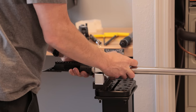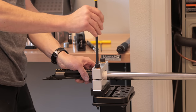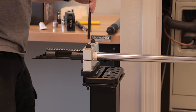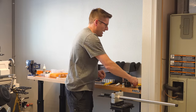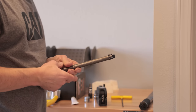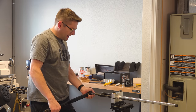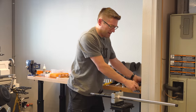Make sure that we don't have contact with the blocks, then just slide it into place. Short Action Customs actually provides the torque specs for these, but I have a pretty good sense of where I need to be. I tighten my barrels to 90 foot-pounds. I've got the Short Action Customs modular action wrench here with the appropriate head for the Terminus action. I already removed the bolt — just feed that in. I have this set to 90. I don't really need that for loosening — pop it — there we go.